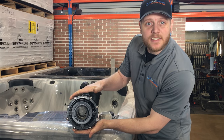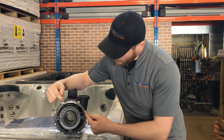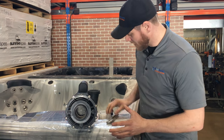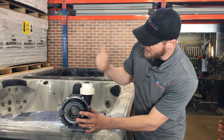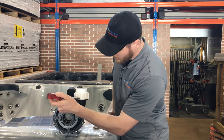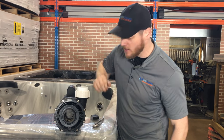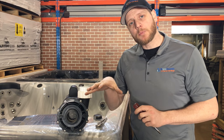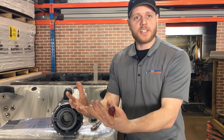Now these wet ends come in different orientations — straight up, or coming out this way or going off that way. Really they're all the same; you just want to locate a bleed nipple ideally up top so you can let the air out. If that isn't working, the other part you'll see is the union that attaches the rest of the plumbing. With a flat-nose screwdriver and a hammer you can place it gently on the ring and tap it until it becomes loose, and again just back it off until you start hearing the air and water starts gurgling out. Tighten it back up and turn it back on. Once you turn your hot tub on, cycling your pump from low speed to high speed and back again helps to purge the air out of the system, and then you should see all those jets coming on like they were before.